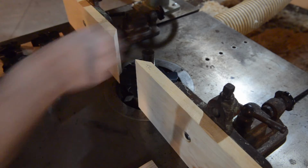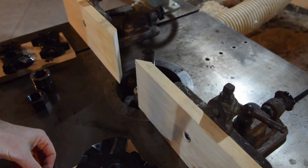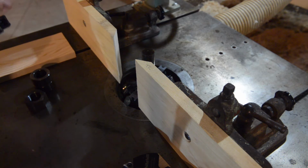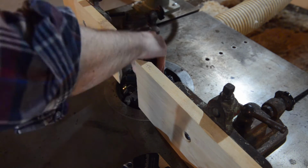Now switching over to sticking was fast and easy, and sure enough produced components that didn't require any adjustment to my setup at all. On a well-guarded machine though, with a 4-wheel power feeder, there's not really much to see, so let's skip right to the results.